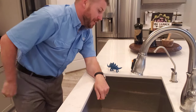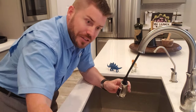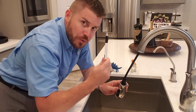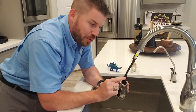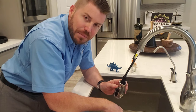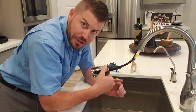If you have experienced that, then what you're gonna need to do is pull out your faucet. Trick of the trade, helpful hint: grab a pen or a pencil or something to shove up in here so the counterbalance doesn't pull this line back up through the faucet and down into the bottom where you have to fish it back out after you detach the head or the nozzle.